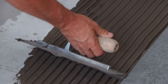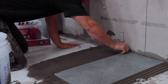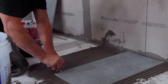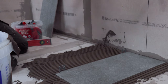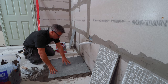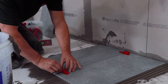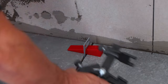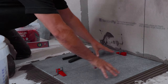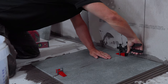Now apply some more adhesive ready for the second tile. When fixing down tiles close to a wall or any fixed objects, always leave at least a six millimetre gap for any movement or expansion joint. These are base clips that I'm putting in place — I slide two of them, one at the top end of the tile and one at the bottom. These are going to anchor underneath this tile and my second tile. Then I check that both edges of the tile are level and give it a little shake, a press, and even a tap to achieve it. I'll give the second tile a gentle little tap, check that it's level, then slide in two wedges between the base clips. These will help the tiles become perfectly level. Once in position, squeeze them together and slide the application tool over the wedges and squeeze it tight — this brings the tops of the tiles perfectly level while creating a two millimetre space between each tile.